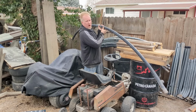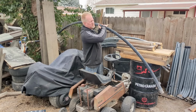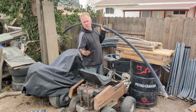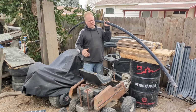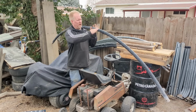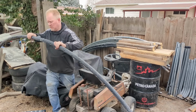But essentially you have a ramp that you drive up this way first and then this way. It makes it so if you're loading something like in the bed of a pickup truck, or something like a riding mower, it doesn't bottom out the belly pan. So I got some heavy gauge steel here, nice tubing, and we got one half and we're just gonna bend it the other way, make an S-shaped ramp. You'll see.